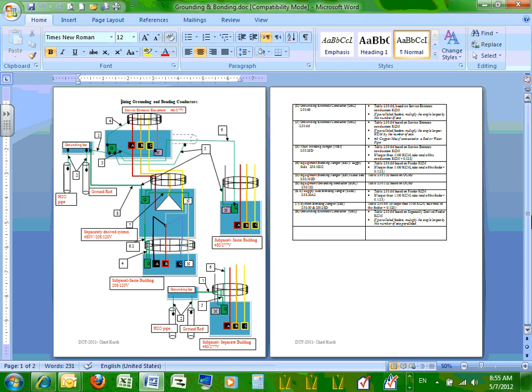Yes, no? So if you were on a power line touching one phase and then touching, let's say, a pole, you're doomed. Or you're touching the other phase, you're doomed. If you are swinging, imagine yourself sitting in a swing on that power line, just one power line, you're okay. Nothing will happen to you. That's how they do it, guys, when they clean these power lines. They tie the chopper to the power line, and the chopper will be at the same potential as the power line, and they start cleaning them. The most important thing is to put the equipment that you're handling at the same potential.